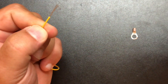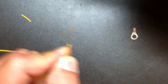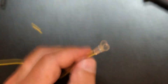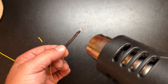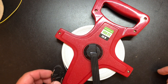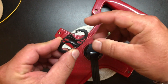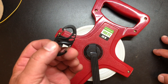I'll be careful — only a few strands in this wire. So what I'm going to do is strip a little bit more and fold it back on itself, just bend this over. Don't forget to put your heat shrink on first, and just kind of cram it in like such. I've got my trusty Harbor Freight 100 foot / 30 meter tape measure, and we're going to use one of these little S-biners — I got these from Pactenna. They've got three holes in there that are great for strain relief, for attaching the other end of the antenna and hoisting it up. That's all the parts we need. Let's get outside, cut some wire, and tune it up.